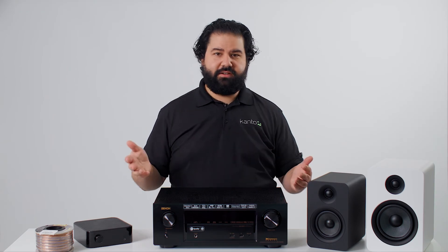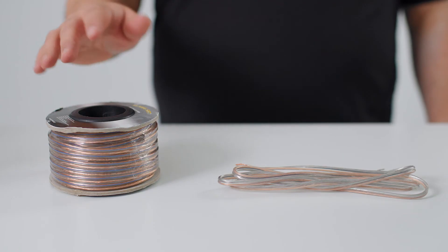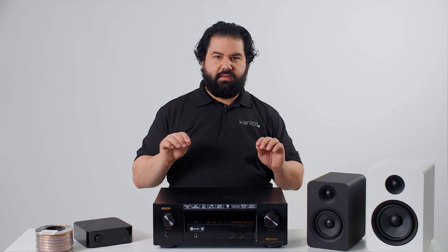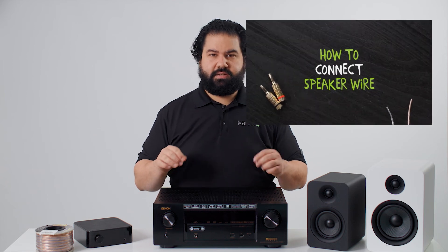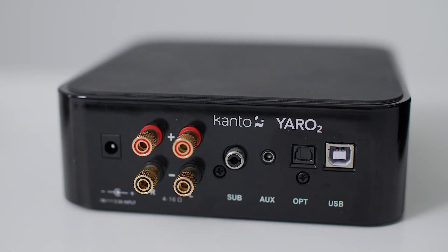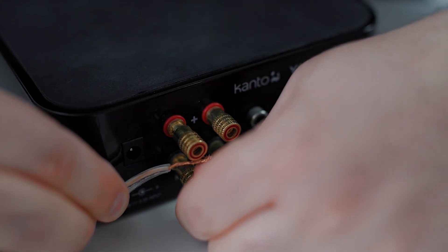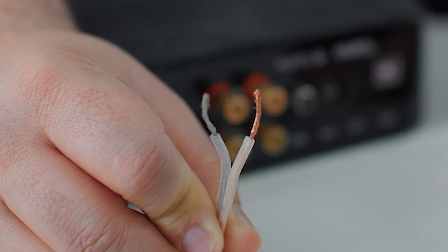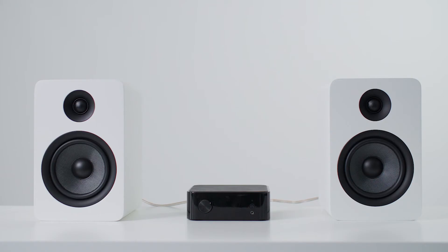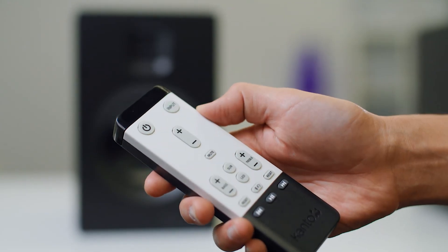Now that you've picked the perfect amp for your passive speakers, it's time to set it up. You'll need to buy some speaker wire to connect each passive speaker to the left or right outputs of your amp. You can buy speaker wire in a roll and cut it to length, or buy speaker wire already cut to the length you need. Watch our video about how to connect speaker wire to binding posts to get acquainted with the process — you can find that in the description below. Connect speaker wire from one speaker to the right or left output of your amp, making sure to connect positive to positive and negative to negative. Most speaker wire is color coded or has a mark on one side so you don't get it twisted. Repeat with the other speaker and output on the amp, then connect your audio source to the amp, make sure it's turned on and switched to the correct input, and you should be in business.